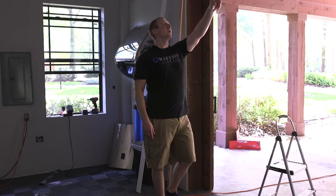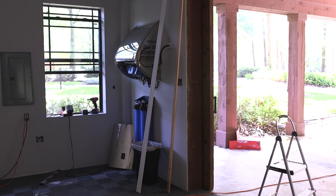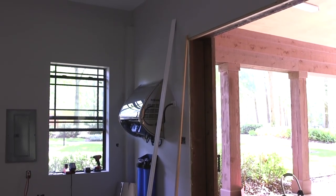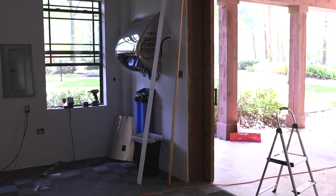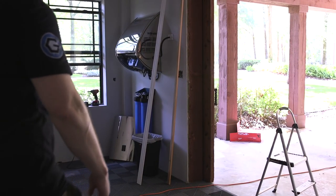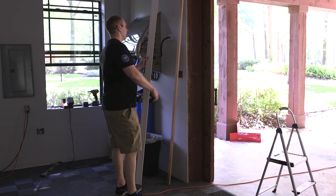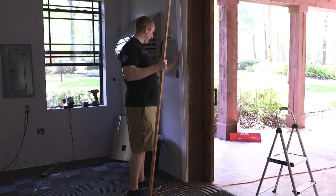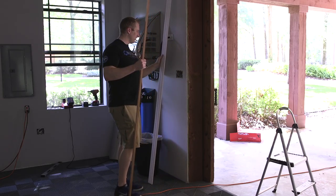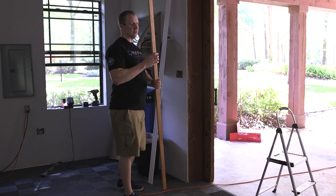So what I'm doing is putting in just a cedar 1 inch or 1 1/4 inch furring strip. So that way I can then bring in the door trim. I wanted to do fancier trim, but this is the only stuff they had in pine. I don't want to do MDF out here. Plus, I don't have enough room between this to do a fancier trim.